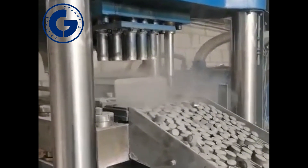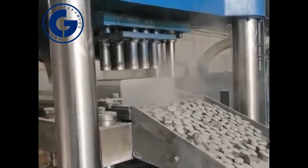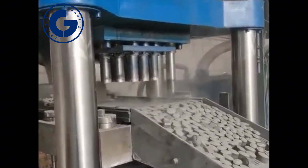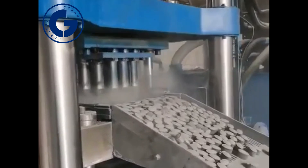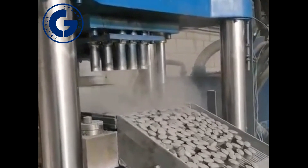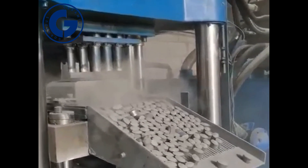The process presses the powder into a so-called green body, a pre-fired solid with high strength and precise dimensions. Dry pressing is particularly suitable for manufacturing flat or simple shaped parts such as ceramic discs, ceramic plates, ceramic rings, and electrical insulators.